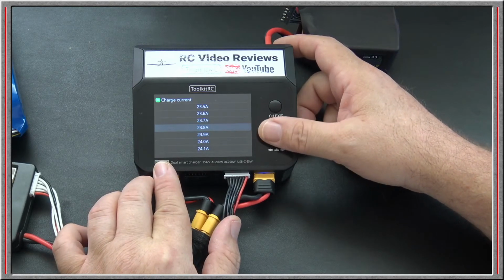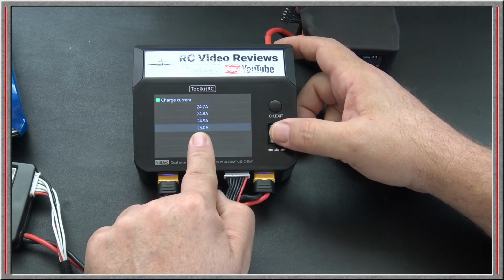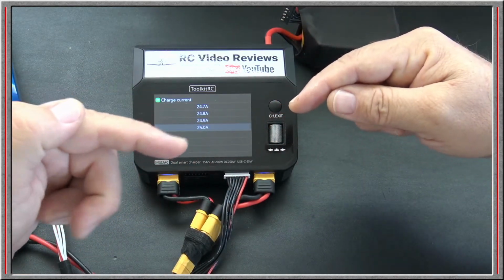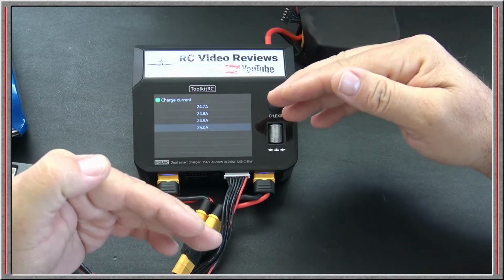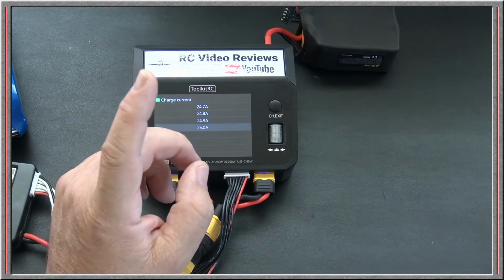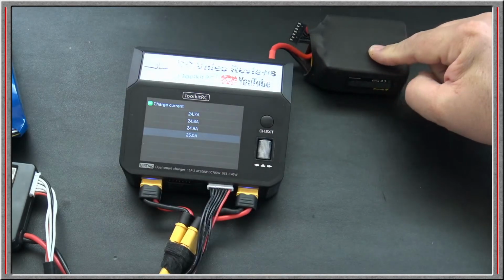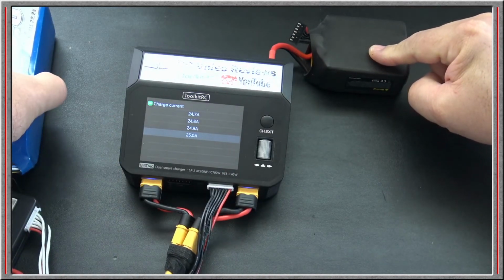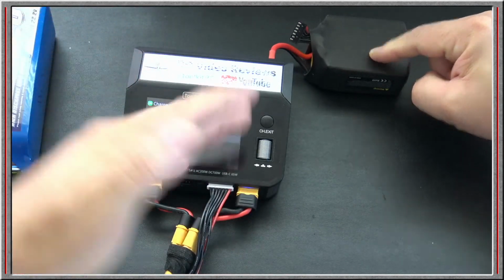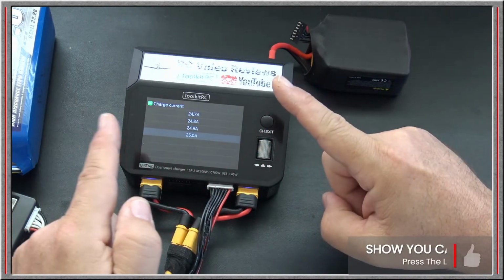So remember what our number was, it was 27.7 amps. I peak out at 25. So that's a maximum amperage limit for the device. What that tells me is I'm not going to hit a full 700 watts. What I expect, and we won't see it, honestly I can't even get there because this battery doesn't have enough capacity to fill these up. But what we will do is run it and we'll see it run up to 27 amps, but I can't show you the peak wattage because here's what happens.